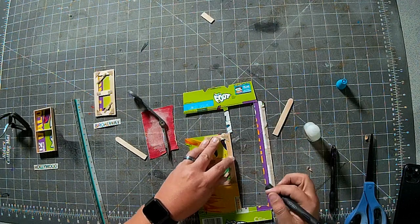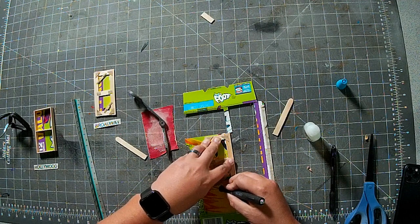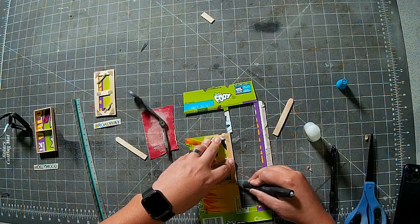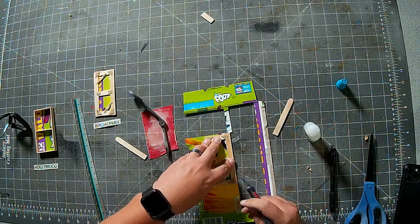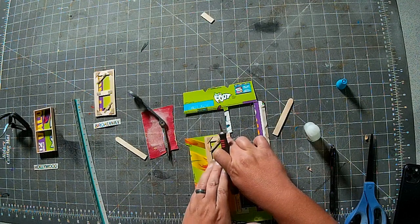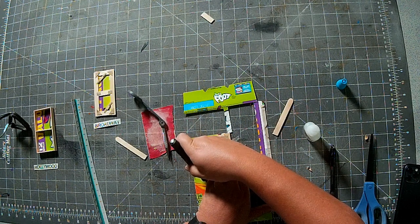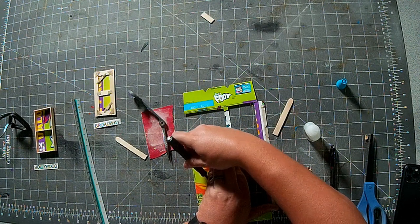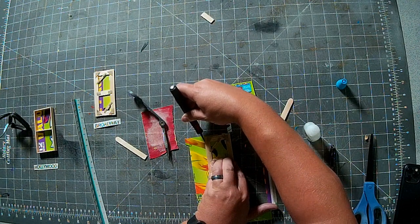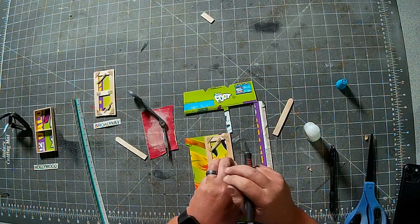When I'm building a full-size Broadway flat, once I have applied my wood to the top surface, I will normally run what is called a trim router around the edges to ensure that it is the exact size of my flat. Normally, dimensional lumber comes fairly accurate. The trim router is particularly important when you're creating a flat of an odd size.